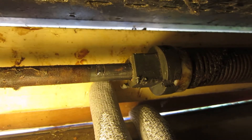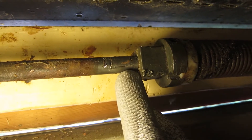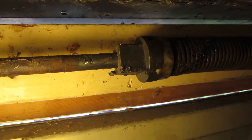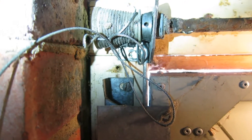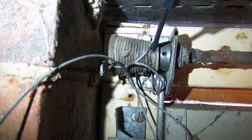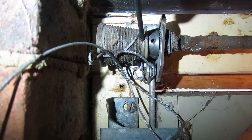Unfortunately it's all a little bit awkward. You can see where the Allen keys spun on the shaft previously, so it needs a flat in there. It probably needs to be burred before it will spin easily to tension up as well. So to remove the cone, untangle the wire, and then simply tap out the pin — you really need about four hands.